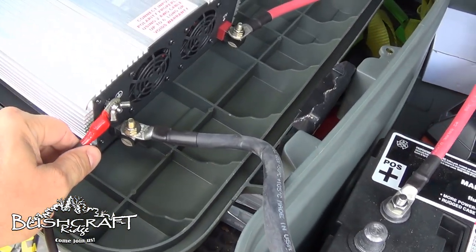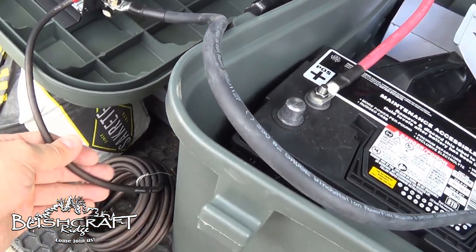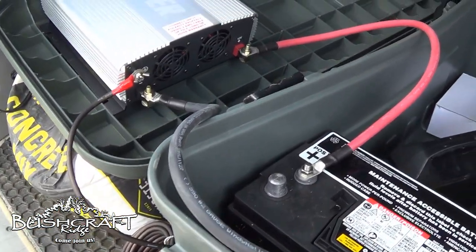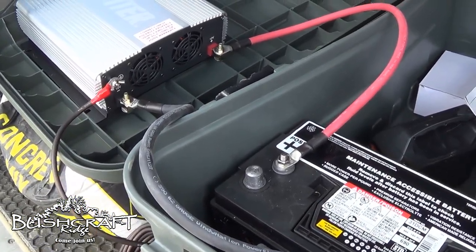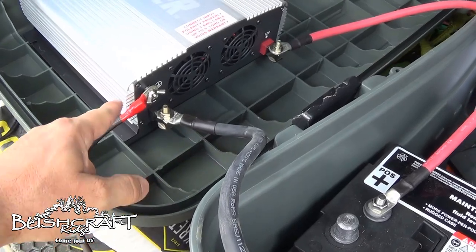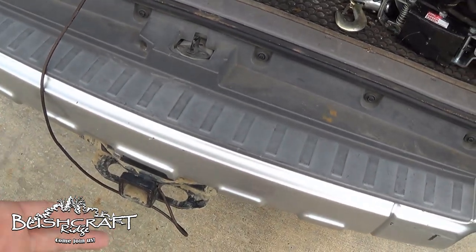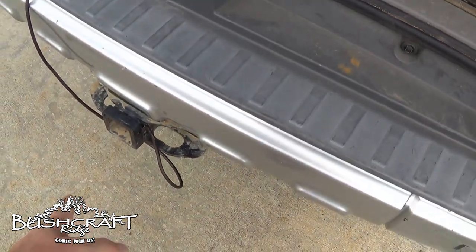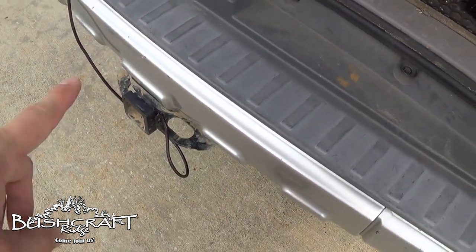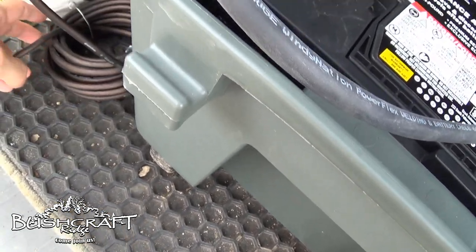The instructions tell you to connect the ground wire first — eight gauge — and this is specifically eight gauge ground wire, 25 feet. I think I got it for about nine bucks. I'll post links to both products in the description, and I'll throw the Jupiter inverter link on there again too — it was about $250 on Amazon but I got it for $119 at Harbor Freight with a coupon. The instructions say connect the ground wire and run it to ground. For a vehicle setup, you attach it to a piece of unpainted steel frame. I'm actually going to get a battery cable clamp and crimp it on there — right now I just stripped the wire and wrapped it around for this first test.